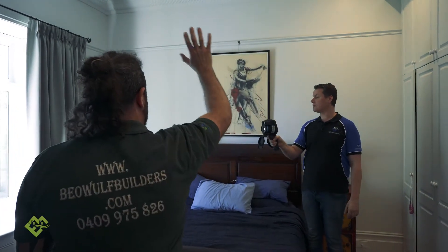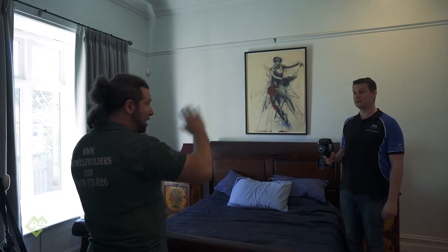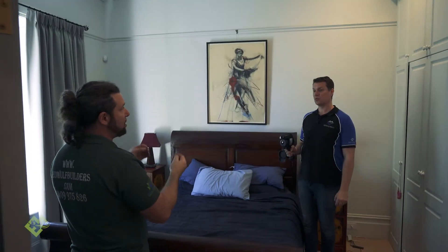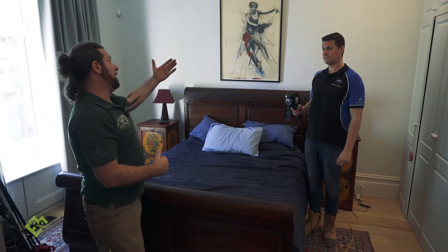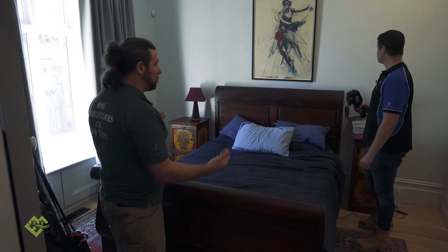This whole wall has been completely rebuilt on that side. It was directly north-facing and all the weatherboards were completely rotted. We've redone all of those in cement sheet, using the thermal properties of the cement to work against blocking that heat coming through on the north face. While we did that, we insulated all of the wall and air-gapped it. We insulate, then put sarking paper, then put a timber batten on, then put weatherboards on — creating two gaps and a cushion of air between the two.